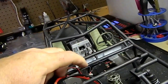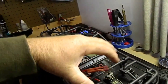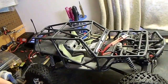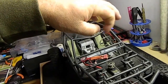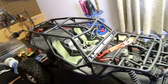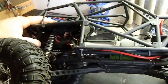This is my servo winch controller. I was having so many problems with servo drift, so what I did was open it up, take out all the circuitry, put the motor back in, and hook it up to this controller. Now I no longer have drift and it was fairly cheap — like twelve dollars. That way you can make a servo winch without worrying about the potentiometer, because even once you get it right it seems like you turn it on and off a couple times and it's off again.